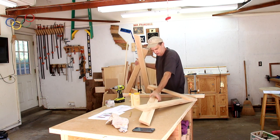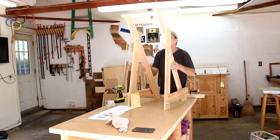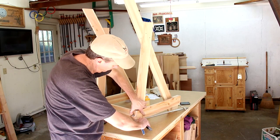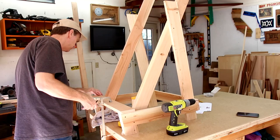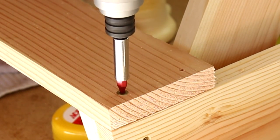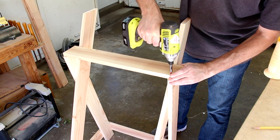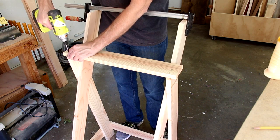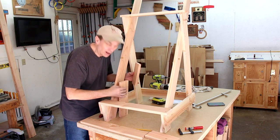Now I can check and see if I did that right. Yes. Now to put this rear cross brace on. Drilling pilot holes will help keep these boards from splitting since they're so close to the edge. These two blocks are going to hold up the middle shelf, and again I've cut a spacer that I'll use to line them up.